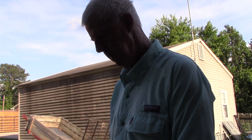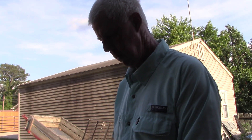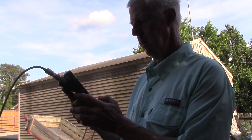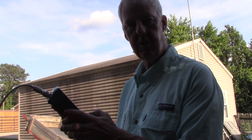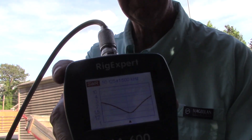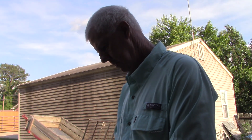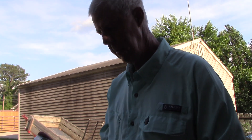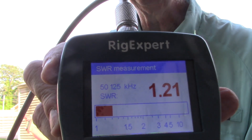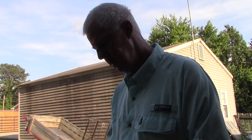Full disclaimer — I'm on my third adjustment tuning this antenna. An analyzer comes in real handy. I'm trying to center it right there on 50.125, and I think that came out really well. Let's look at the low spot for the SWR. We're right there at 1.21 — I say that's a wrap on this one. Let's go back to the table and talk about the adjustments that I made.